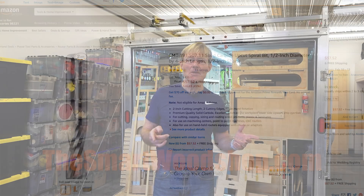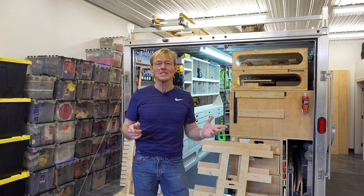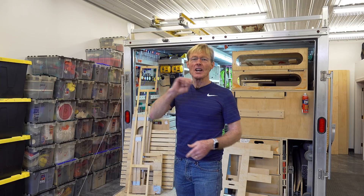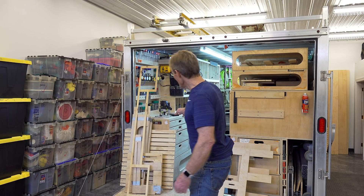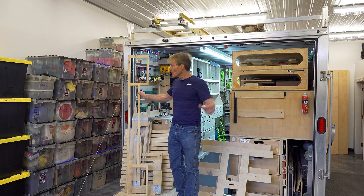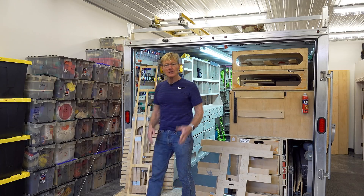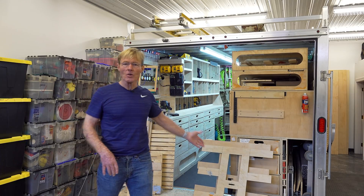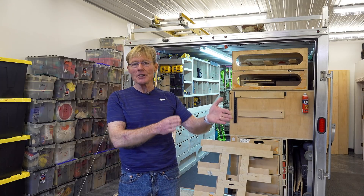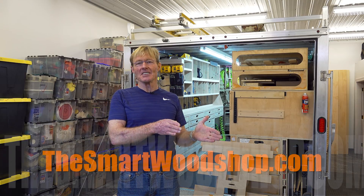One last very important element of having that $5 tool outperform a much more expensive CNC machine is to save your templates. Write on them, save what they are. I have a whole stack — duct-taped together — with templates for all different parts of my workbenches, my stand-up desk, my cubbies for drilling or cutting dados, my sawhorses, and many more. Find a safe place in your shop or garage, and you'll be able to pull it out and make that piece exactly right every time.